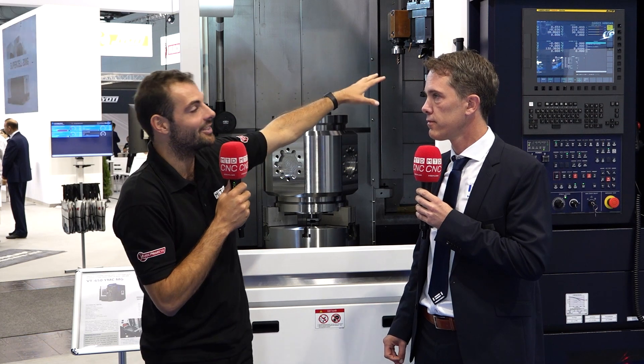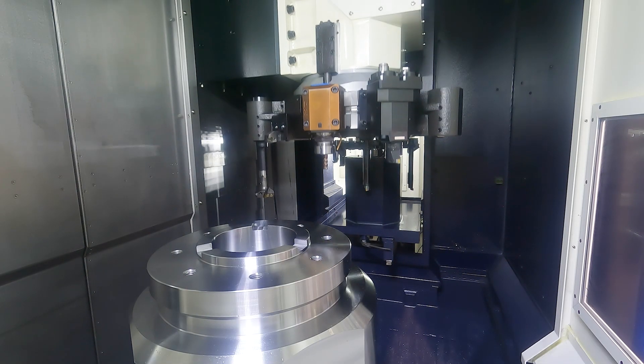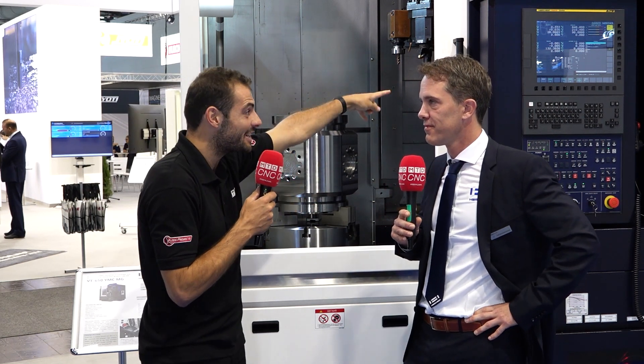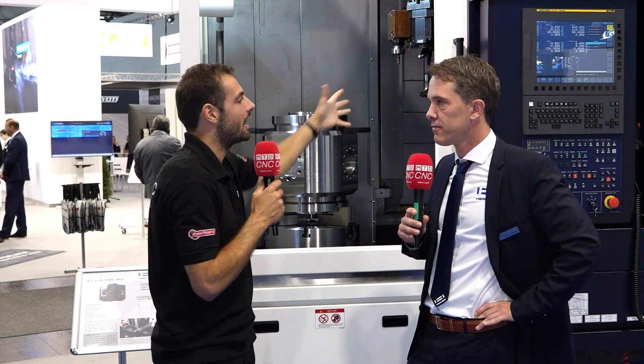What else about the machine makes it well suited to automation? There's a really interesting feature on the right-hand side. We have a tool magazine, and the tool magazine enables the customer to have greater autonomy — letting the machine run because you have spare tools, so you don't have to change them as often. And some viewers might think there's one tool magazine, but this is actually a second tool magazine. So you have a tool changer here and a second tool changer, making the best of live tooling on the main machine, plus loads of different turning tools for various operations.